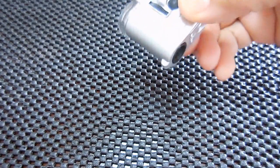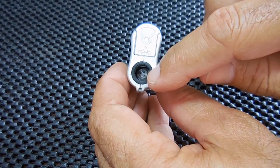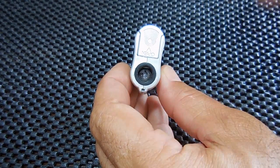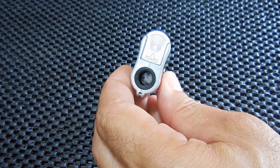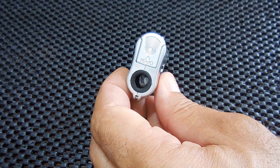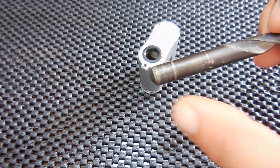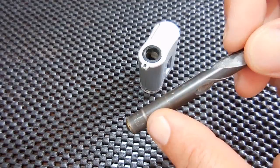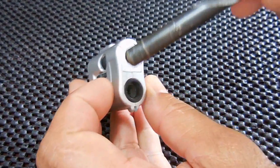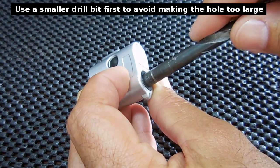In order to connect the Creative Live webcam to this pocket microscope you're going to have to enlarge the hole at the end here — this was a small hole in a piece of plastic. You're going to need a twist drill or a drill bit, either 21/64ths or 11/32nds. What you're going to do is heat the end of the bit over a flame or over a gas burner. Get it nice and hot — don't get it glowing, just heat it enough so you can insert it into the plastic and get the proper diameter. You push it all the way in, then twist it and pull it back out.